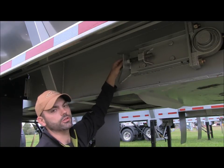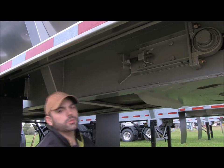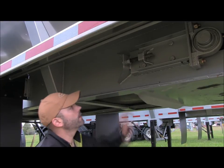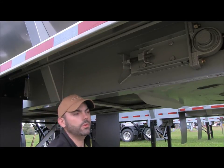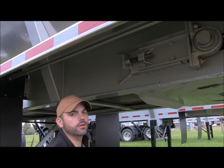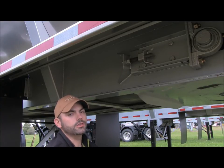Once they're slackened off, there's an adjuster bolt on both sides of the trailer. You're going to want to do this with the conveyor system running. You do one to two turns on each side, and in between each of those turns you're going to go to the rear of the trailer at the inspection door and check your chain tension. Continue this until you get to the proper chain adjustment.